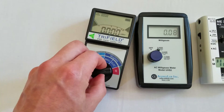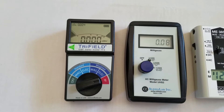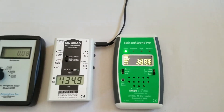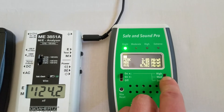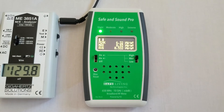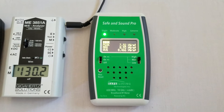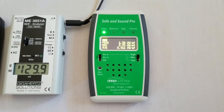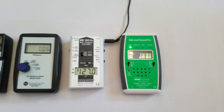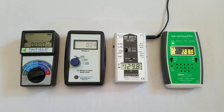For radiofrequency, the TF2 is at about 1 microwatt per meter squared, really showing you that there's nothing in the environment here. However, when we move over to the more accurate and sensitive Safe & Sound Pro and turn the volume up, you can hear that we're near a Wi-Fi router and there's a local cell tower. This would allow you to find that Wi-Fi router and turn it off, or use some type of shielding material — and you wouldn't be able to figure that out with the TF2. So I also don't trust the TF2 for radiofrequency.